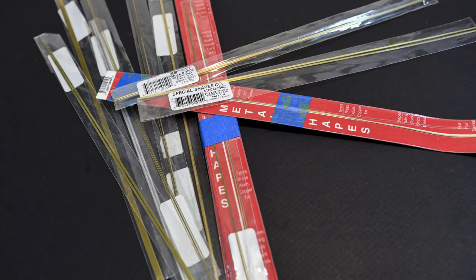Alternative three: because at this scale you're working with fairly small pieces of brass flat stock, you can actually buy this flat stock at most hobby shops - K&S Special Shapes, every hobby shop has them, and most hardware stores have it too. The stuff is so small at this scale that you can probably get away without having to anneal the piece to get it to bend around the mandrel. And even if you do have to anneal it, you can probably do it right at the kitchen stove, or with a propane torch, which would certainly be more than adequate for the job. Aren't you glad you stuck around to the end?